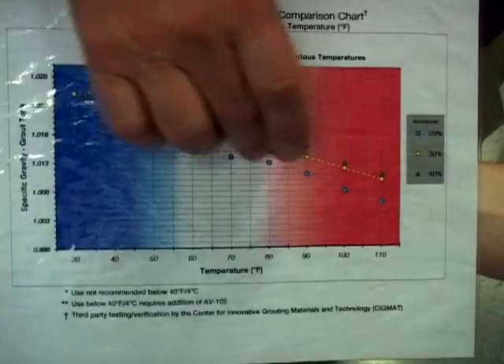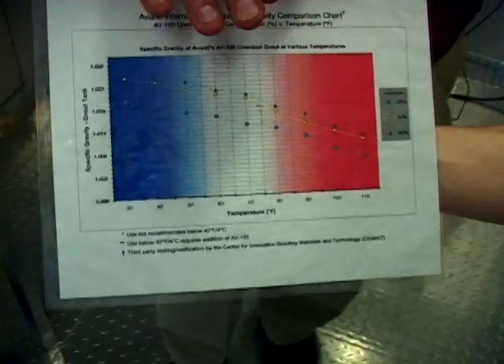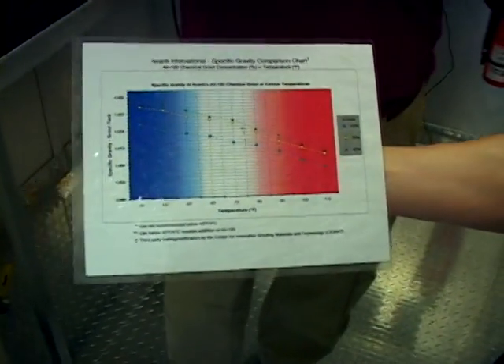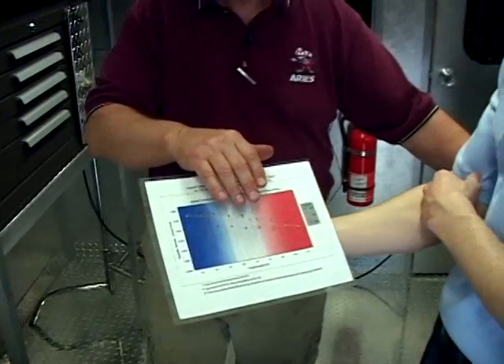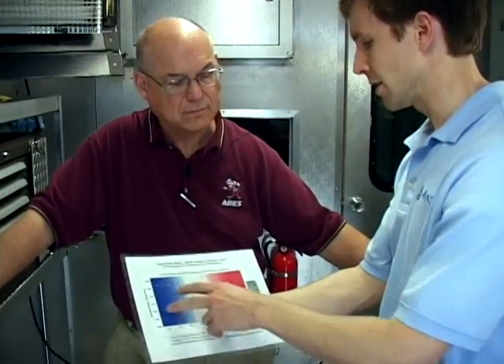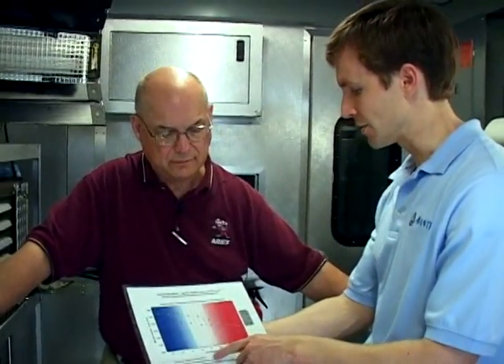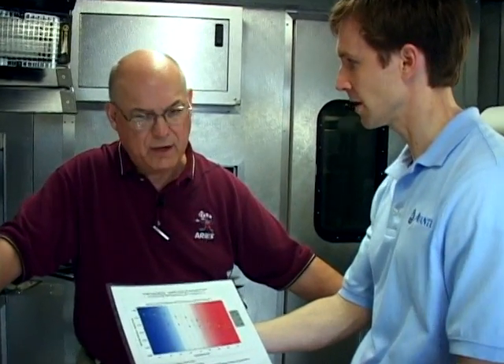You want to be in the mid-range of 60, 70, 80 degrees, because these are the ranges you find in the sewer pipe. When we inject the chemical, we've got to get it immediately out into the soil and saturate the soil before it gels. So that's our guideline. Using this chart, we can keep these charts on the truck. An inspector can come on, test the specific gravity using a hydrometer and the temperature, and know how much grout is in the batch — right away, roughly what the percentage is — and we can ascertain that the contractor has a good mix.